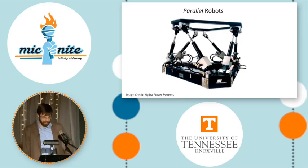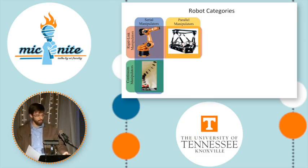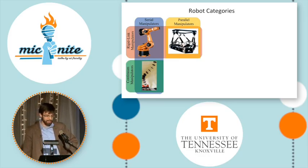But not all robots are serial. This kind of robot has its links connected to each other in parallel. A crab or a spider with its feet glued to the floor might be a biological parallel here. Each link can independently change its length, which then moves the top platform around in space. Parallel robots have a smaller range of motion than serial robots, but they are stronger and more precise. So serial robots have a large range, parallel robots are strong and precise, and continuum robots are flexible, dextrous, and miniaturizable.